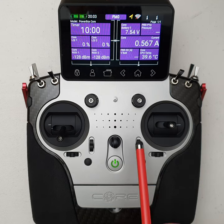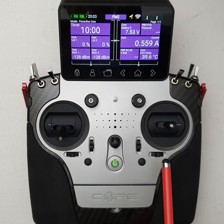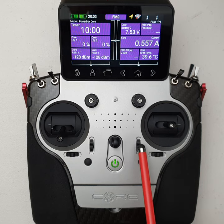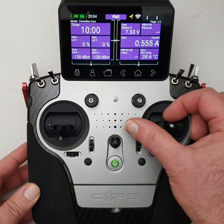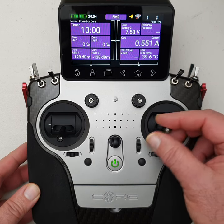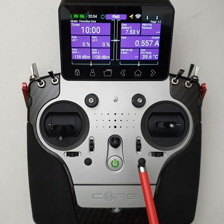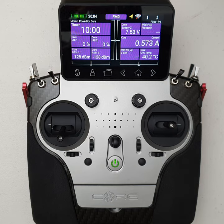The trim levers are offset. Normally on most transmitters, you'll have a trim below the center line of your joystick and the side one up higher, making them a bit awkward to reach when you're flying and need to trim. With the two together and closer together on this transmitter, they've thought about it — it just provides the user slightly easier access to use the trims. They're standard momentary trims, fully programmable as per most transceivers these days.